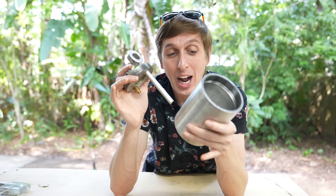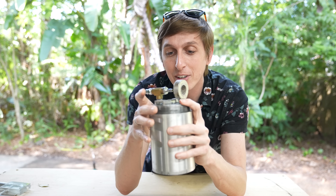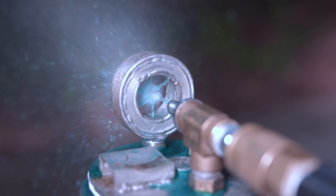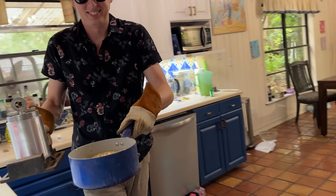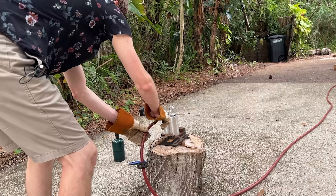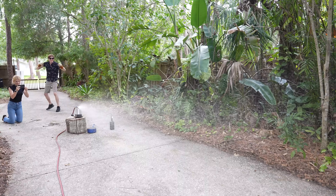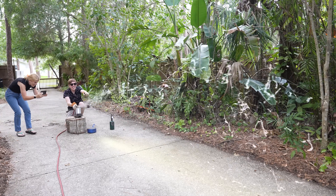So this is it — the culmination of days of research. I call this the last hope for my video. How this should work is I fill this with molten sugar right here, and then instead of trying to use suction to suck the sugar out, I'm gonna pressurize this with compressed air, and a stream of compressed air is gonna come out of this nozzle right here, where it meets the six streams of sugar, and hopefully turns into a giant cloud of cotton candy. I preheated the tank and the nozzle in the oven, then carefully carried everything outside and filled the tank up. Three, two, one. Oh, I don't know — I don't think it's working. Oh wow, look at that. It's working.